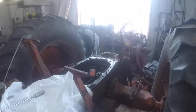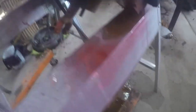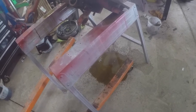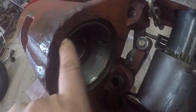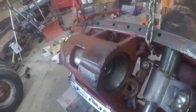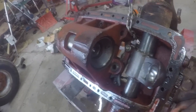I got this thing off the tractor, so now there's a big gaping hole in the tractor. It's off and I took the dog bone out. It's dripping and oozing out of the port that goes into the cylinder — all that stuff's coming out of that cylinder. Honestly, I don't know if we can save the cylinder; it might be shot. There's a snap ring we've got to pop out to shove the whole cylinder out, because the cylinder is just pushed into this casting.